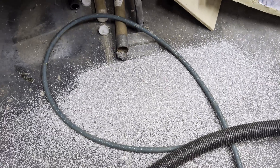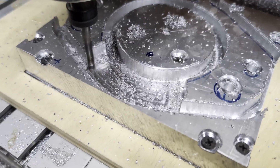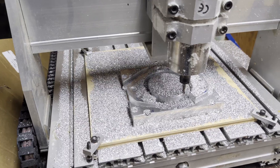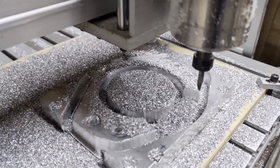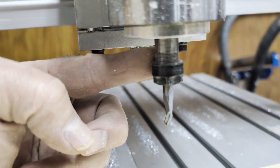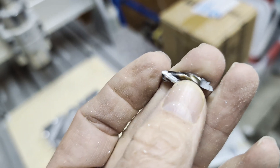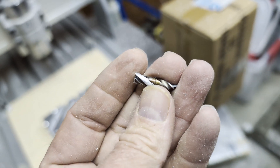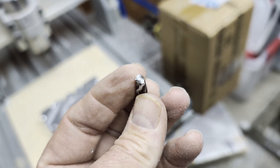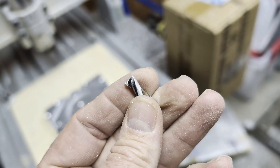Doing a little checkup on the thing. There's getting to be a pile of aluminum. Well, some bad news: got a little ways down and the bit broke. You can see it broke way up the shaft. Unlike a drill bit, you can usually just pick the aluminum out, but this aluminum is stuck hard on there — welded in pretty good. I'm going to guess the bit was starting to get dull. That made things hot, the hot aluminum started sticking, and it got worse and worse.